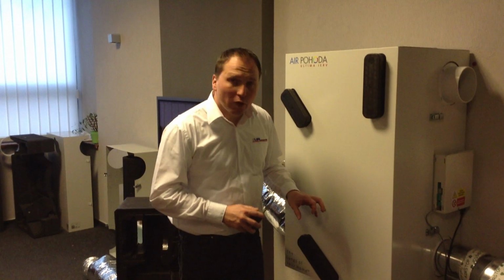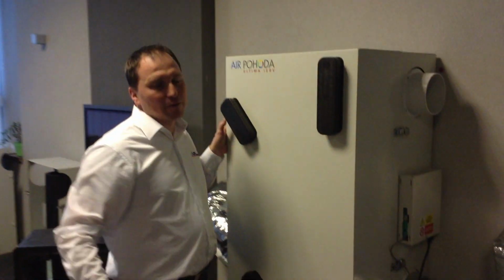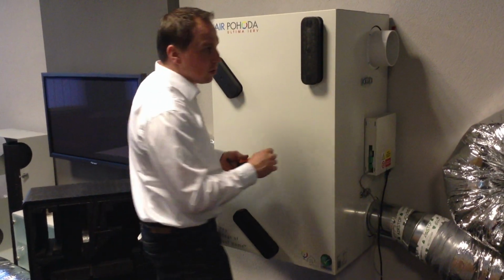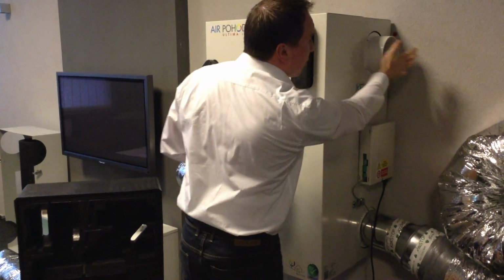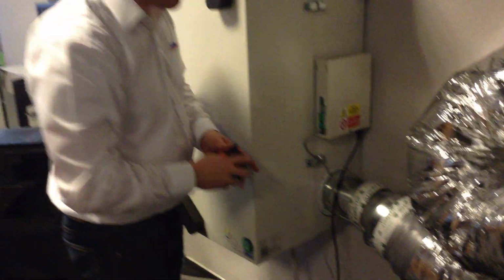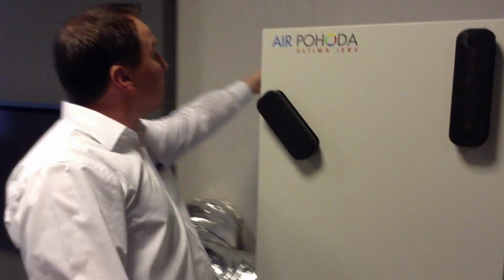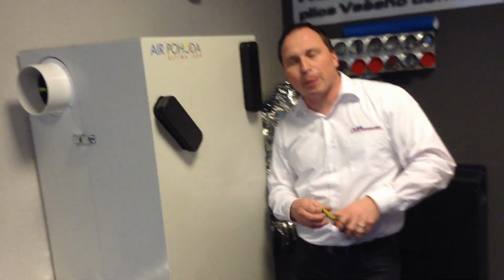Alan, this video is on your request, so I will show you a few of those items you were interested in. First of all, this is how our unit looks when it's mounted on a wall. Quick explanation to anybody who cares. This opening is the suction of the waste air from the house. This is the waste air out of the house. From the other side we have fresh air into the house, and this is the fresh air from outside.